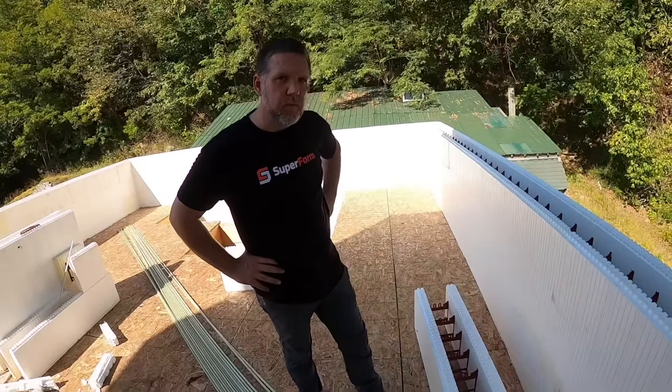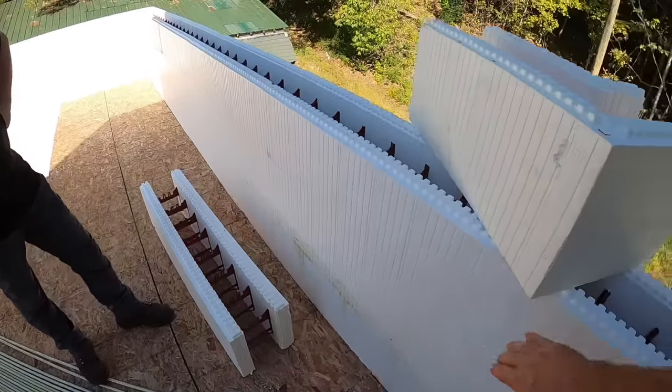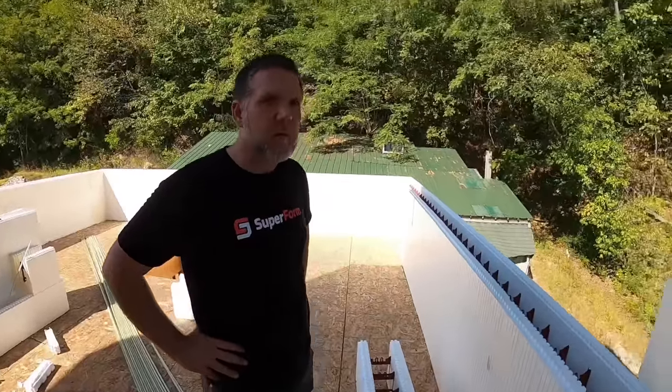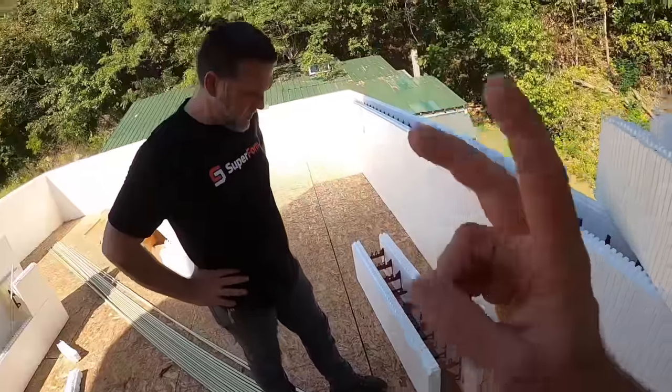And the other thing that you guys market is that you don't have to foam this block down because it has more surface area touching the foundation. More contact surface. And I still foam down because that's just what I'm used to, and it's not a hindrance. You can still foam down. That's not a big deal. So that was their main reason for making them non-reversible.